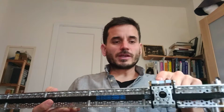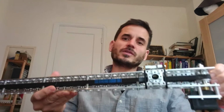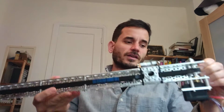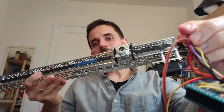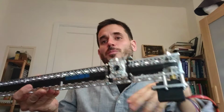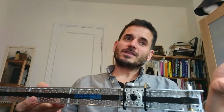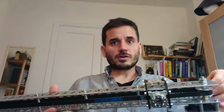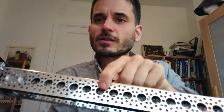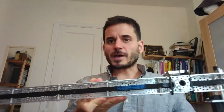But something else that we can do with this that you can't do with other servos is sample its position. Because we're reading the encoder from an Arduino, we can sample its position and replace the former position in the sequence with the new position. So that's what I've set up here. Let's have a look, and we're going to overwrite this previous position here. Turn it back on.